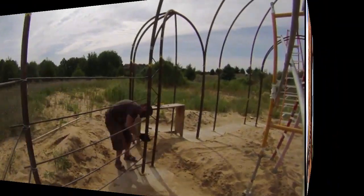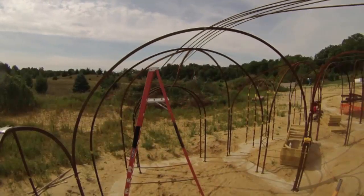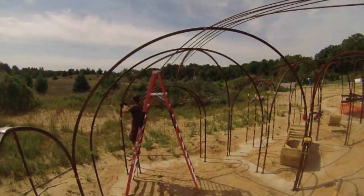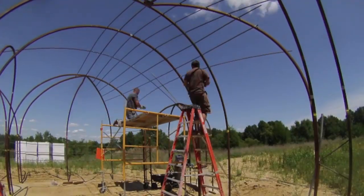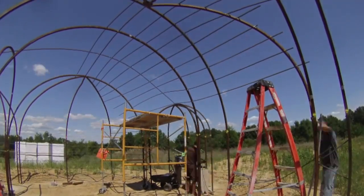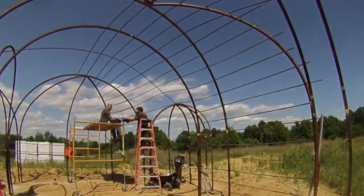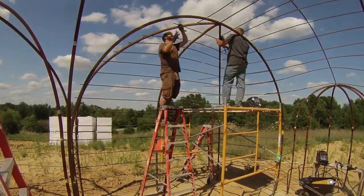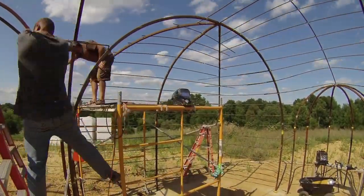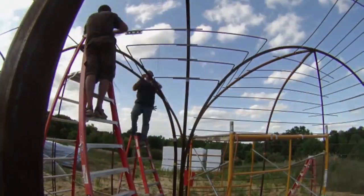We ended up using the notch method to keep the rebar from sliding down the steel arches. Using the grinder we made a little notch every foot that we could then use to catch the wire tie — it was quick and easy and one four dollar disc would do the notches for the whole structure. Aaron measured and marked and then I came behind him with the grinder to place the notches. Then we spread out the horizontal rebar and tied it all in place. Things progressed pretty quickly until we got to the vault intersection, where we had to measure and bend each piece before tying it in place. With my bender it was pretty easy, and we did it in two overlapping pieces so we didn't need to be too careful with the lengths or try to manage two bends on one bar.